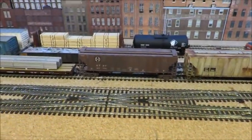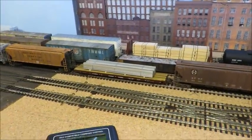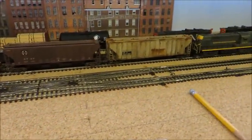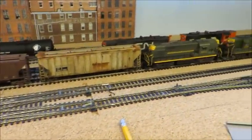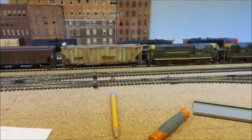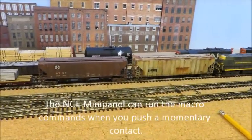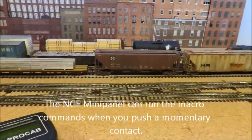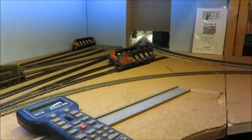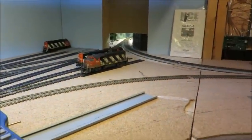The Switch 8 is pretty powerful. It takes the place of a diode matrix - one button will control all of the switches in the yard. I plan to do a panel here at the front so that one button for track 1, one for track 2 - just push the one button and it aligns everything for it. So that's my staging yard to date, and I hope you picked up something good from this series of videos. Thanks for watching.